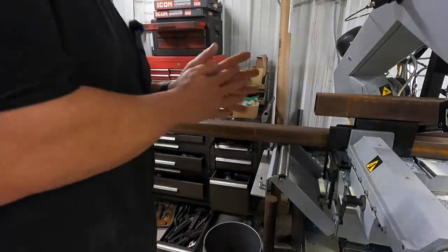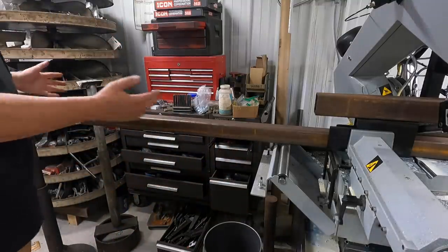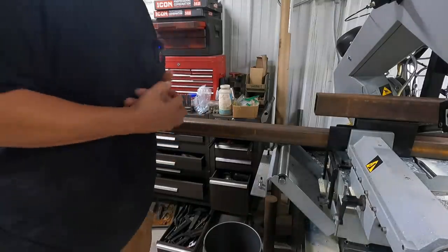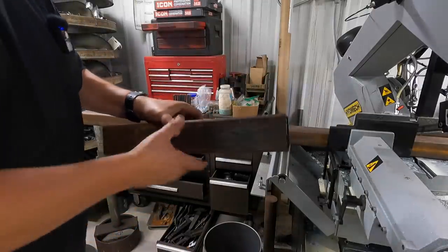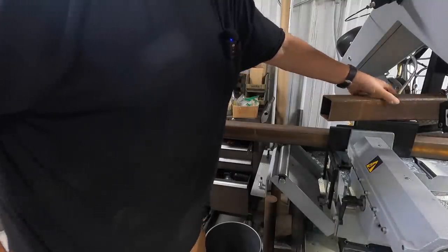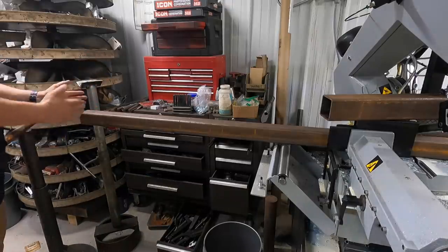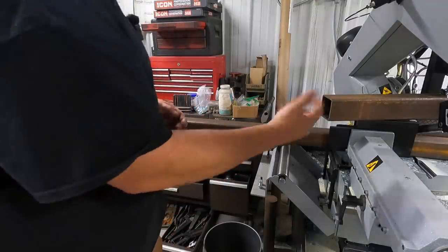And so what I did is I took some measurements. I put the cherry picker out here outside in the corner of the truck, and I got a rough measurement. It's about 3 foot from the center of the hitch out here to where the crane's gonna be. So I just rounded up, I went an extra foot. We're gonna cut it 4 foot long plus half the length of this. So once you stick this in there, this will be all the way through this piece right here. But the thing is that it'll be adjustable. So if we need to, we can slide it in a little bit and get the crane portion a little bit closer to the tailgate or the back of the truck, because it's just going to be a slip fit through this tube right here.